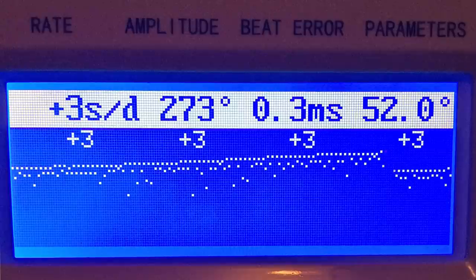The other thing that we'll look at is the little trace line on the time grapher, and I'll show a close-up picture of it in a little bit. Basically, you have two little lines. Every time the watch ticks and tocks, it goes tick-tock, tick-tock, tick-tock. We want to make sure that the trace of those little blips or lines on the time grapher readout screen is not erratic. We don't want all this bouncing around and jitter.